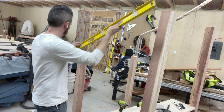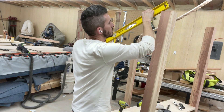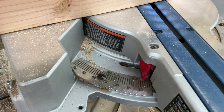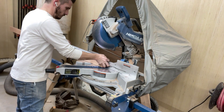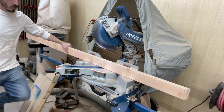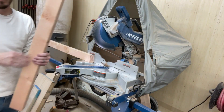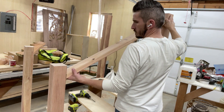This has got to be one of my favorite features of this Stanley level — it's four feet long but it's got one dial that rotates that will tell you the degrees when you're leveling something on an angle. I set that up, rotated it, and it measured out to exactly 29 degrees, so that's the degree I'm going to set my miter saw on to make sure all of my cuts are exactly the same when I do the rails. It just occurred to me that I don't actually know what you call the upright posts underneath the handrail — someone could shoot a comment and let me know what those are called.